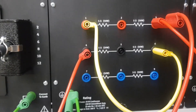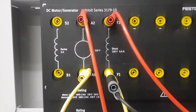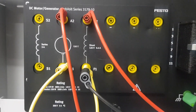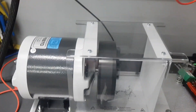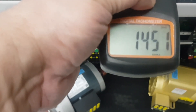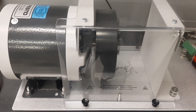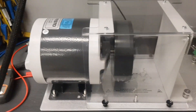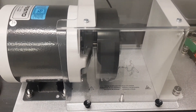For consistency, I now have a total of 20 ohms in series with the armature winding. The speed has been reduced again. So the conclusion is: if we insert resistance in the field, the speed will increase; if we insert resistance in the armature, the speed will be reduced. Please join me for a brief explanation of why that is.